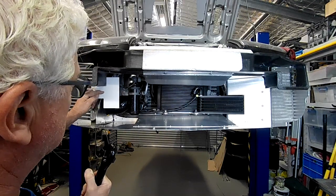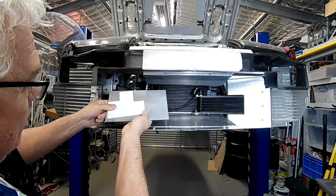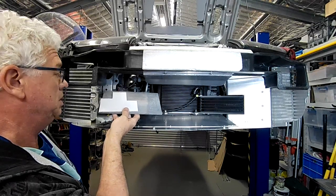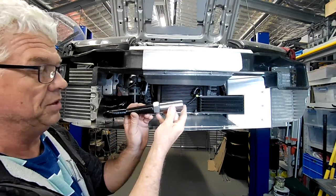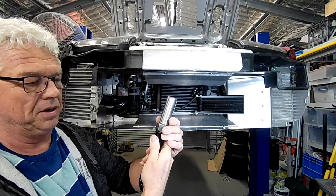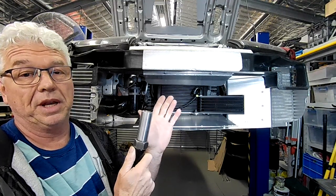I don't have any suitable plate for this, but what I do have is a bit of gal. So once I get the size properly sorted out, I'll cut this out of this galvanised plate here, and then I'll drop it in some acid to get rid of all the galvanising off it so that I can weld it, and it should be pretty sweet then. I'll get the spacer done so it's welded together, and then I'll probably put it back on the lathe and turn all the hex off that nut and just make it look sort of pretty fancy. I'll get a little bit more done and we'll have a look at how it's going.